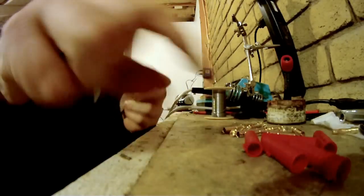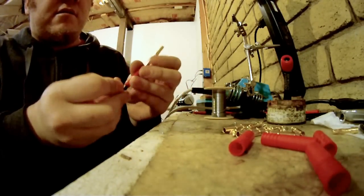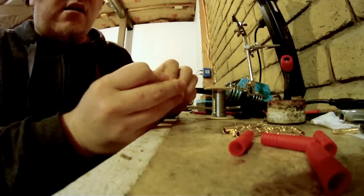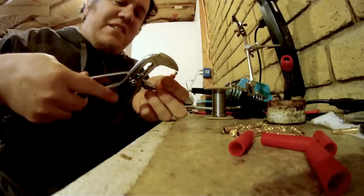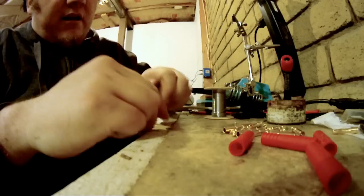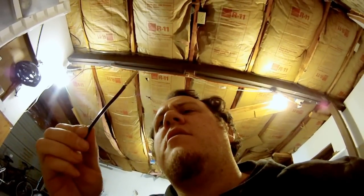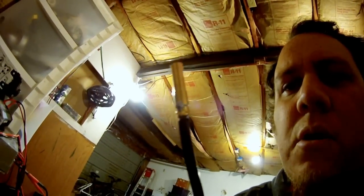Sometimes it can actually get pretty hard to get on. So what I do in that instance is I stick the housing on, stick this on there, get some big pliers, and kind of squish it. When you hear that little click, you know it's on there good. The only thing you have to worry about is occasionally a little solder will spill out of that hole and you might have to hit it with a file, because the housing usually won't go on without a fight. You could do this in less than a minute each. I hope I taught you something — have fun riding.